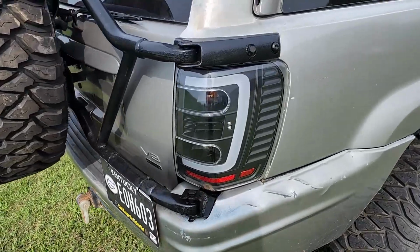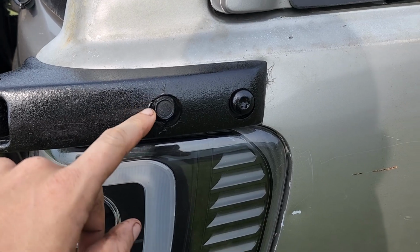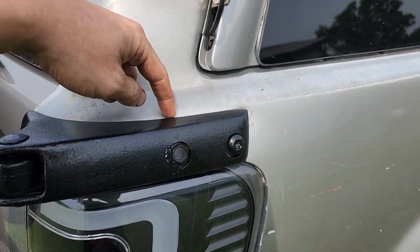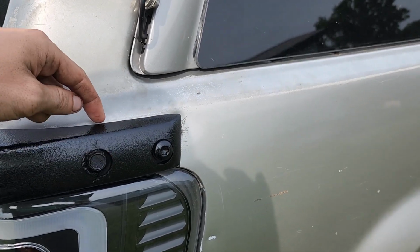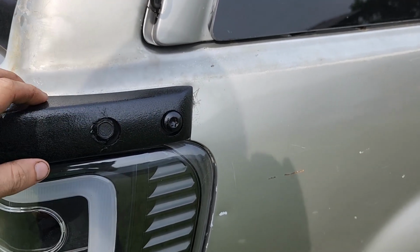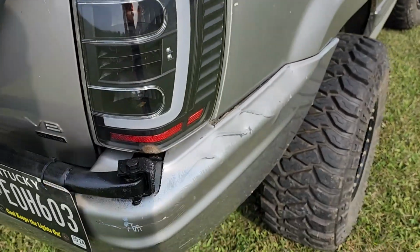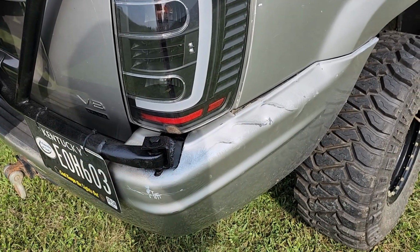You can see the bed liner that I put on here. You can see a little bit right there, some of the silicone that's in the holes to help waterproof that. I put some on the holes themselves and then on the bolt threads of a couple of the early ones, and whatever got smushed out. So that should be nice and watertight. Same with this bolt in here. All of these down here go through the body down and below.